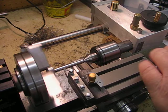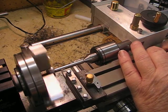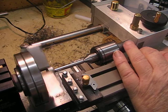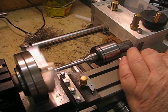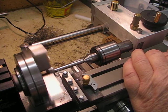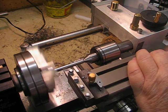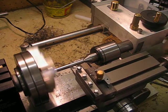I like machining stainless — I've found it very rewarding; you get a nice finish usually and it machines quite well. The 303 of course is free machining — probably the nicest to machine. In my working life we used a lot of 304; I was in the medical trade, working in medical devices in a physics lab, so quality material was important.